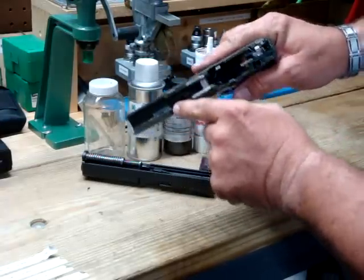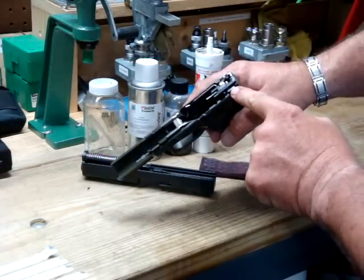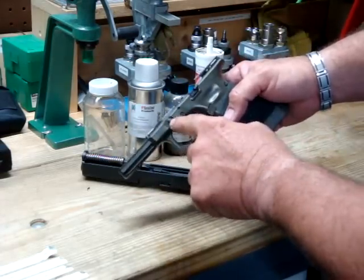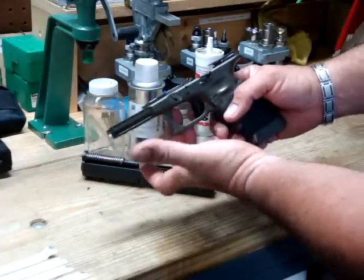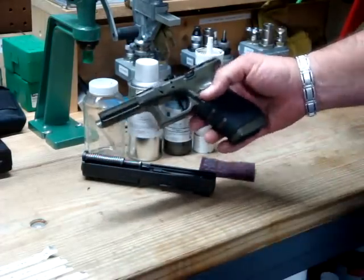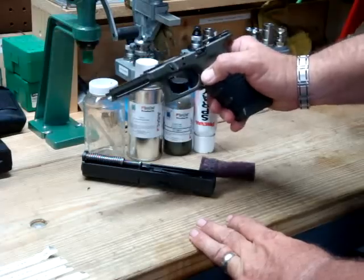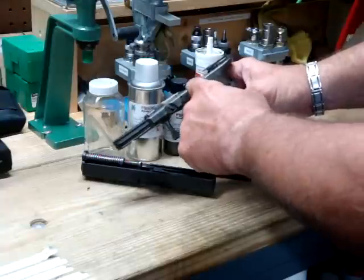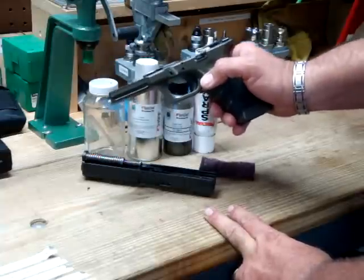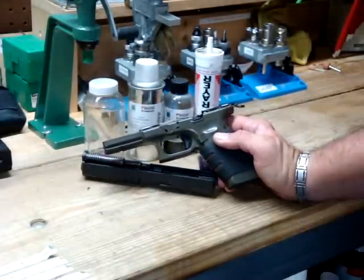I did the same thing on the other side, and of course the block and trigger mechanism comes out. All that's left is your slide rails on both sides. Slide release comes out, pins come out, takedown lever pushes down and slides out, so everything's pretty much stripped on the gun except for the serial number, slide rails, and magazine catch — I left the magazine catch in because I wanted it green, not black. After it dried about two or three hours I came in and operated it a few times to free up any paint that may have coagulated, so it wouldn't crack or take finish off. It works fine.